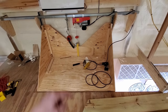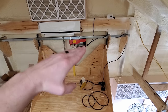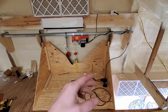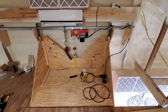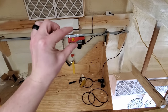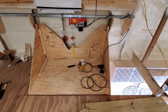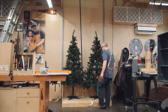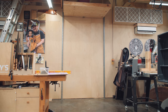I've yet to test the fall arrester, but if not, I can extend that a little more. The super strut holding the motor is working just fine. However, there's a little bit of flex to it — this super strut is bending down and bouncing a little bit. I don't think it would ever be a problem or ever bend. That's just what metal is doing, flexing just a little bit. So I don't think that's going to be an issue, but if it bothers me enough, I can bolt a second piece of super strut to the top to stiffen it quite a bit. That's basically it. This is working just as intended. And finally, the lift can be used as it was intended to be used. This is definitely one of those projects that instantly deserves a spot atop the 'I should have done this sooner' list.